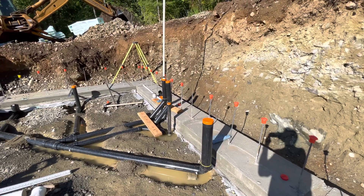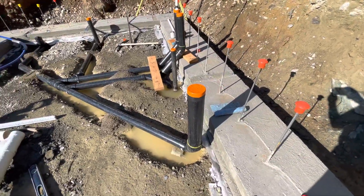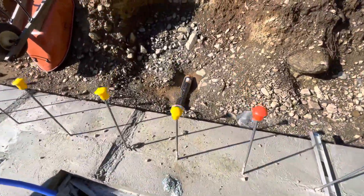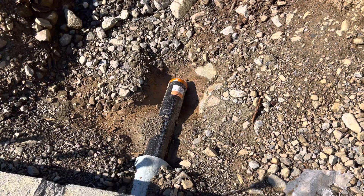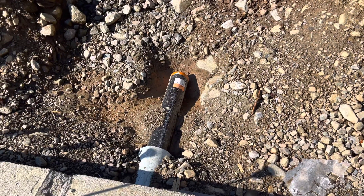I know the inspector wanted a hard pipe solution, so I'm giving it to him. These caps worked out really good — I just taped them up a little bit and they were really bulletproof. That end should see the full pressure of the full 10 feet on the end of that four-inch cap, and it held water really well. I just hammered them on really good and then taped them with electrical tape.